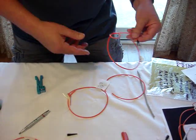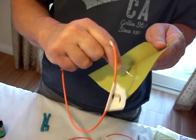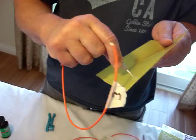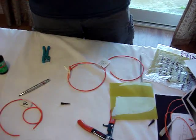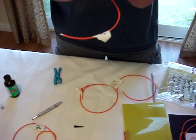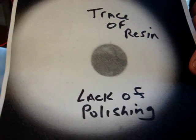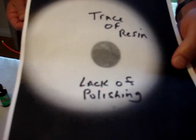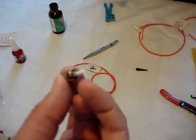Once you've cleaved it, you have to polish it. This is what we call air polish — you take this and air polish it, kind of like sandpaper. You do a figure-eight motion right here — just air polish. You start with the green one, which is the air polish. Also, be careful with glue amount — if you put too much glue, that's called trace of resin and it blocks things up. Two drops is about all you need — just put it down there until you see a little bit coming out of the end.